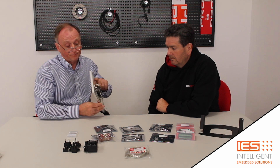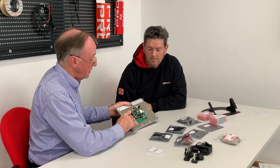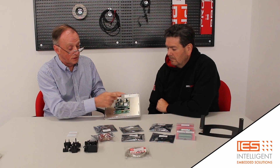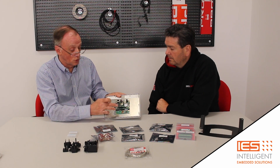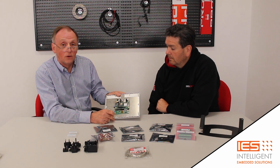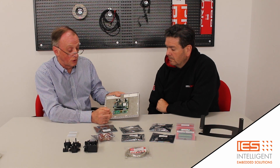This particular example is the 9.7 inch and this one has the IP65 sealing on the front of it. You've got a machined aluminium chassis and on this particular version you've got a projected capacitance touchscreen. Going through to the back, you've got two main PCBs. The top one is the processor board and its host board. The processor is a Cortex-A9 1 GHz with a very long life, and in its standard form the processor is capable of wide temperature operation.